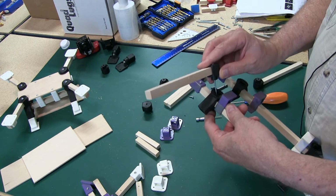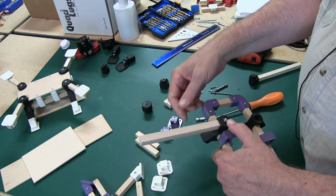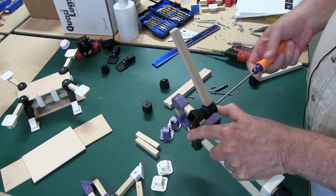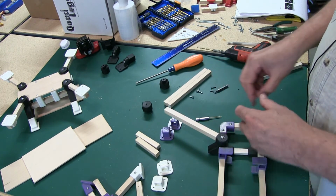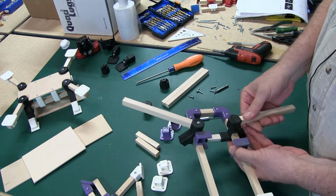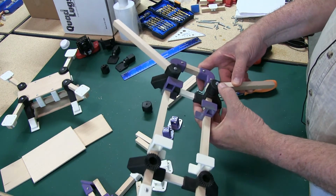Now it's probably smarter to go ahead and put the motor mounts on here first. I'm not going to be smart. I'm going to wait. You get it started, and then you don't need to hold the screw anymore. And then I'm going to run 60 degree back this way, or 30 degree. It's 15 degree increments, 2 clicks this way. And we're not going to cinch it down real good yet, but we're going to do it enough to where it'll hold itself. Grab another nut for this side. And again, we're going to go 2 clicks, 30 degrees this way, or 60 back.